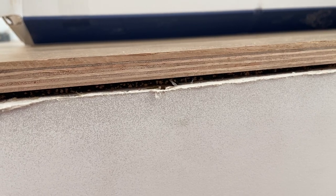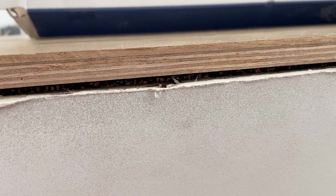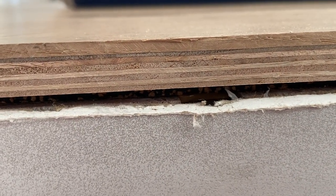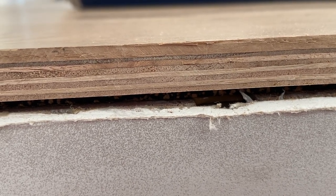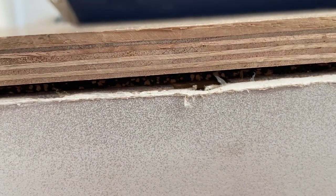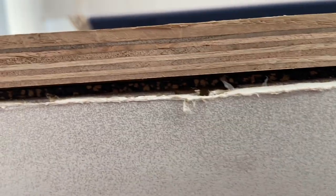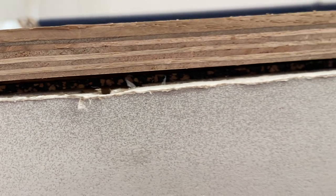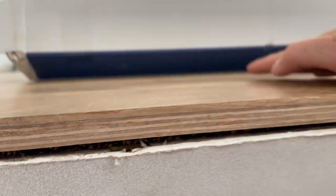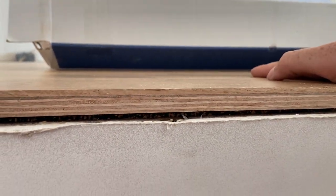To get a better look at what the flooring system is, I'm in the stairwell now where we can get a side profile so you can see exactly how it all goes together. As you can see, this is the side profile of the flooring. Looking closer, you can see that the old flooring is pretty much in line with the top of the gyprock. Then that had a glue coating on top where we've laid that rubber underlay, that black stuff running right through the middle. Then we've had another layer of glue on top of that, and we sit the new flooring system directly on that.